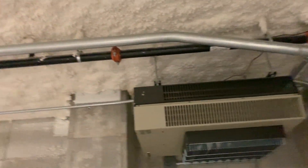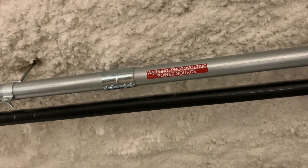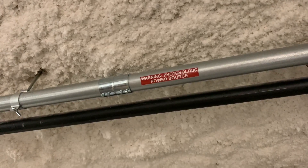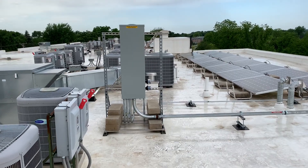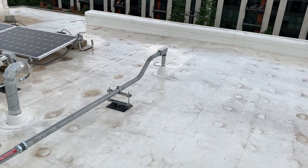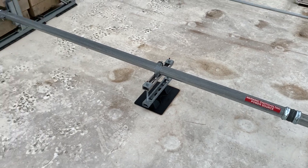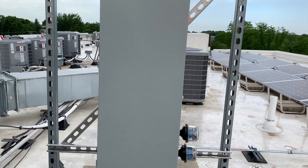Now we're going to work our way out of this electrical room all the way up to where the solar panels are. It's just a bunch of two inch EMT going up and coming out of the room. On this pipe you have to have stickers every so many feet — I want to say around every 10 feet — saying it's part of the solar system. You're going to get a big stack of those stickers and go through them quickly, so order extras. It runs all the way over to a junction box where we found a set of common walls that got us all the way to the roof. This is a rain-rated panel up on the roof and you can see right where we pop up from that common wall. It comes up properly sealed, and all our EMT on the roof uses rain-tight fittings. You still have to have the code stickers even on the roof, and it's preferable for everything to come into the bottom of the panel for water purposes.